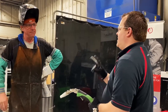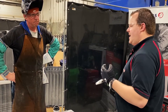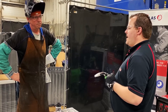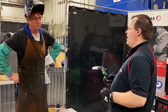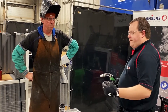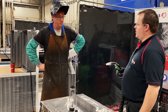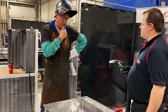However, the third parameter — weld positioning — is important to get the best possible capture. We say that's a discipline that needs to be discussed by the business and the welders. If they want to get the best possible return on investment out of this technology, have a discussion about weld positioning to get the best possible capture. If we align all three stars — air flow, gas flow, and weld positioning — we will capture up to 95% of the fume at the source through this gun, in all positions, at all times.